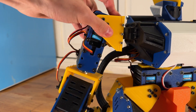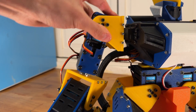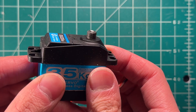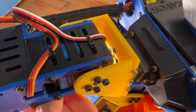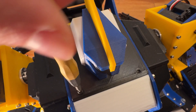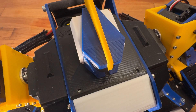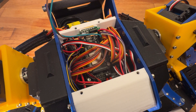However, certain joints needed to be retightened after every match, specifically ones without bearing support, because there is a lot of mass riding atop a small servo shaft. Servicing the bicep and shoulder servos was doable, but the same couldn't be said for the torso joint, which is buried underneath the electronics. To get to it, I needed to rip up the servo wires first, then remove the microcontroller stack — a cumbersome and risky process that left a ton of room for error.